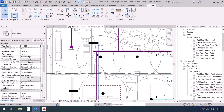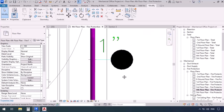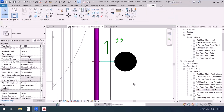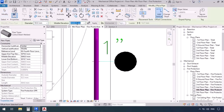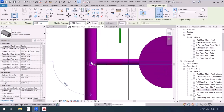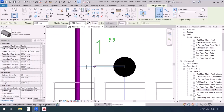Let's go back to the plan. For this one, I'm not going to have to add a pipe upwards — I can just connect it from the side. This pipe is at elevation 3900. I'll get the pipe command PI, then enter 3900 with diameter 25. Now I'm going to click and click. We've connected our sprinkler. They didn't connect because we stopped at the axis, so I'll drag it to the edge so they connect. We're going to repeat that here — click and click.